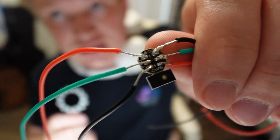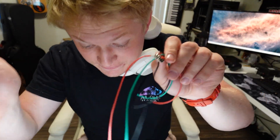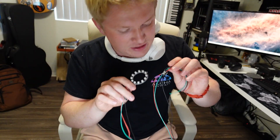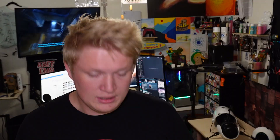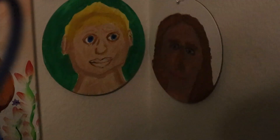I finally got all of this connected — single LEDs connected at one end, then at the other end connected to a ring LED, and that end connects to the Arduino Nano. It was six solder points per part, which was kind of a pain. I'm not great at soldering and this was basically my first time, but I'm glad I did it first to get it over with. When I finished wiring everything, I was certain it wasn't going to work — so when it did work on the first try and I was able to upload the code Everett provides to the Arduino Nano and switch the LEDs from blue to orange using the two buttons, I was shocked.